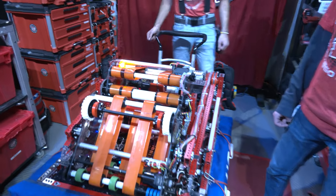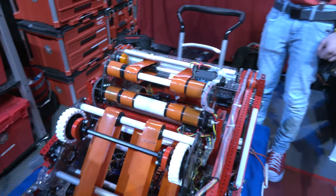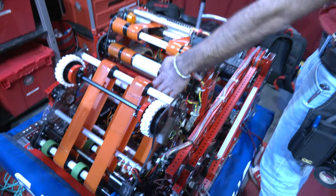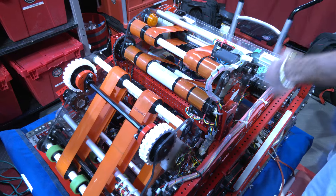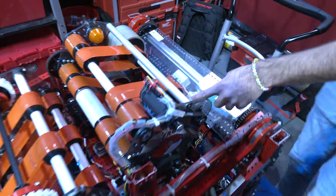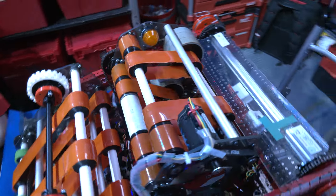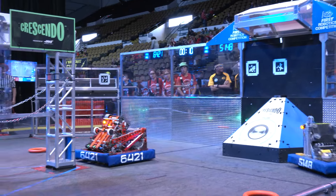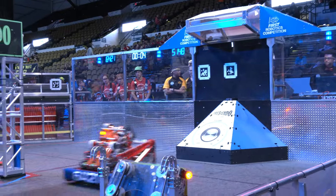We've got to talk about the shooter on this robot — just a very smooth shot. After the transition feeds it, if we're deciding to shoot from the speaker it will sit in here until we get into position, then the shooter will flip up and feed it in. Because we only have wheels on one side, it stabilizes the shot and gives it a little bit of spin, which lets us score at farther distances and increases our adaptability — we can shoot from farther back if someone's playing defense.